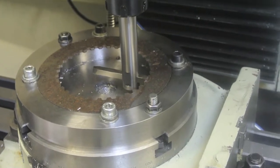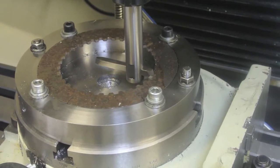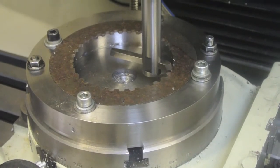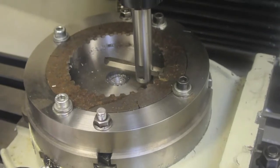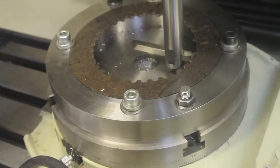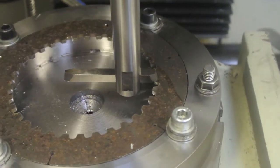Well there we see it working. I don't think it's cutting anything yet, but I'll keep moving it in — advancing it after each cycle, one full turn. I'm just checking the program out, making sure it does actually do the 34 slots. Oh, it is cutting a little bit there — I can see it cutting on one of the teeth. Now I'm onto my third cut and it's definitely working. I had one huge cut which showed me something wasn't quite right with the material or the former cutting of these.